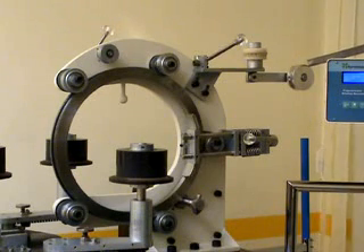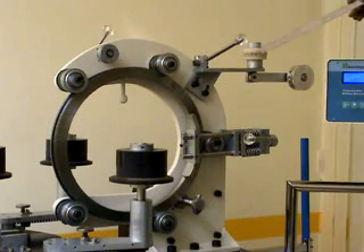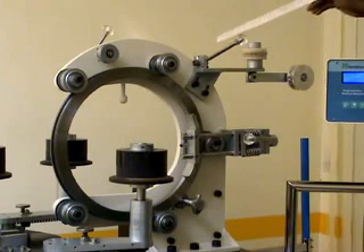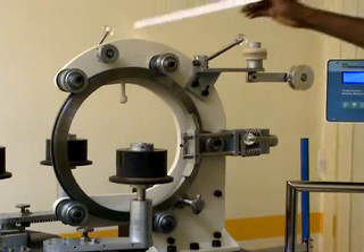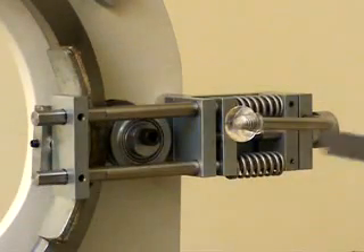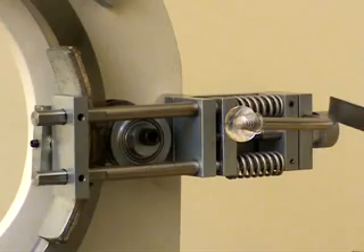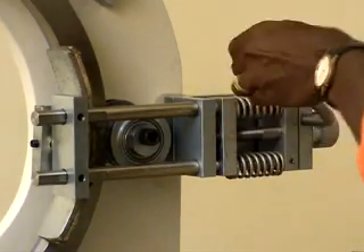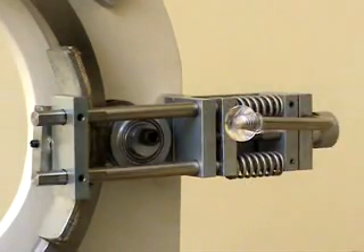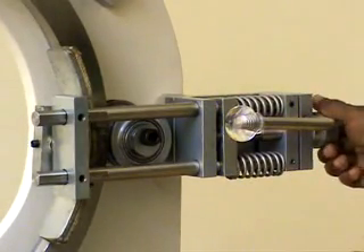The winding head's main parts are the copper guider, copper tensioner — which has an adjustable screw to adjust the tension on the copper wire — cutter to cut copper wire, and copper guiders. The brake assembly consists of a brake shoe, brake lever, and brake adjustment screw. This lever is used to brake and unbrake the magazine. The brake shoe holds the magazine intact on braking.